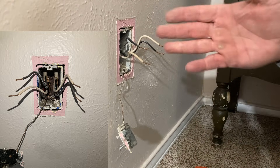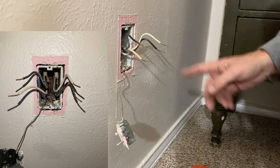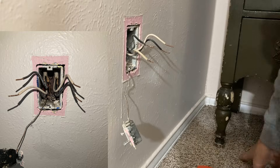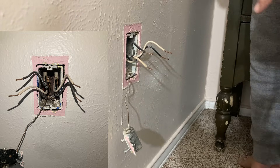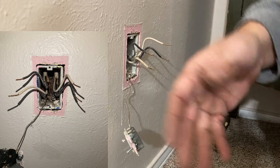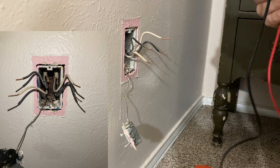Here's what I'm emphasizing: you find that whole row of dead devices, pick a spot near the middle, and take your power apart — in and out. Right now I could put a wire nut on this, reset the breaker, and the power from everything back toward the panel would be on. That leaves this side down for me to troubleshoot. Divide the remaining devices in half, open it up again. You're using continuity between hot and ground — not turning the breaker on and off — and that will save you a boatload of time.